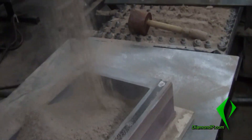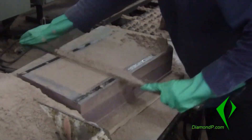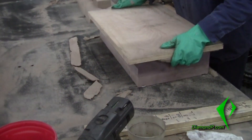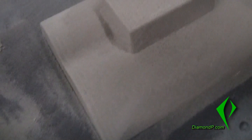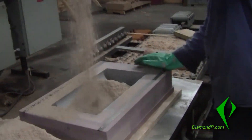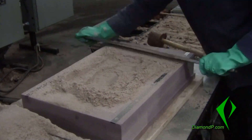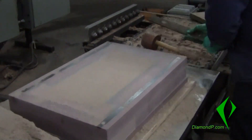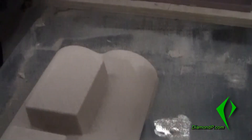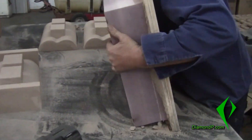Now it's time to make some cores. Taking the core boxes up to our air set station. The sand that we are using is a silica-based sand that we add a chemical agent to, and it sets over time when air is in contact with it. It takes about 10 minutes per core, but the plus side of this chemical is it's extremely easy to knock out. When we made these cores and made the castings, we actually didn't even have to hook up the supercharger castings to a knockout machine — we just hit them with a hammer a few times and the sand fell apart. And here you can see the loose pieces I was talking about being dumped out of the core box and pulled apart.